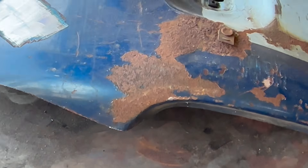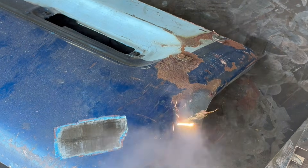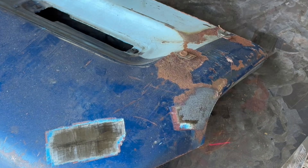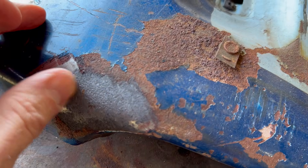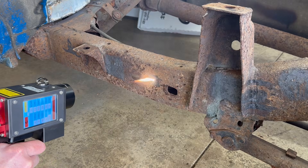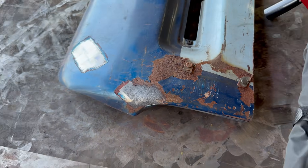Now let's see how it does on this heavy rust, using the same settings as before. This 200-watt pulsed laser I'm using is the FLC200 by Fortune Laser. I bought it a year ago and it's worked flawlessly and saved me so much time on restoring parts. I made a full video about this machine — link in the description. Here's a close look at the rust and it has been completely removed. Even the pitted parts are fresh clean metal. Scaling rust can be an issue for the FLC200, like when I tested it on an extremely rusty frame where more rust was found underneath the scaling. But cleaning up surface corrosion and light pitting like this is no problem.